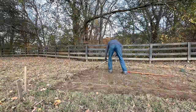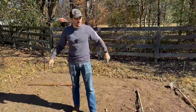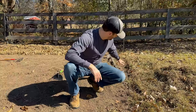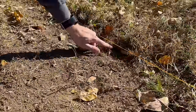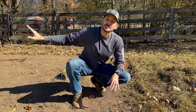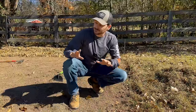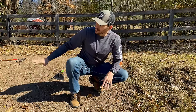Yesterday I finished removing all the grass — I didn't do any leveling but I got that off because you don't want the grass there since it will die and compress, and you want a nice firm foundation. I also have the string lines all laid out. The site not only slopes down but also has a hump in the middle. I leveled everything out and wanted to get the string line as close to the surface at the highest point as possible, so I'll have the least amount of buildup at the lowest area. Putting the top of the timbers level with the highest point reduces the work, but now I have to dig the trenches, set and level them, and then level the center.